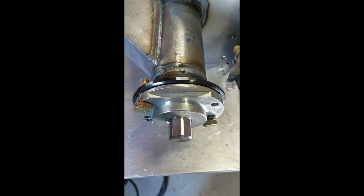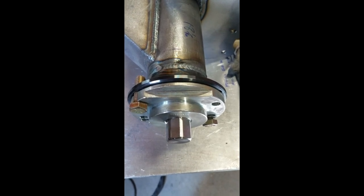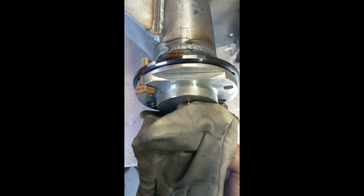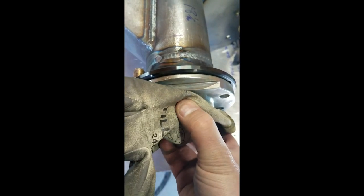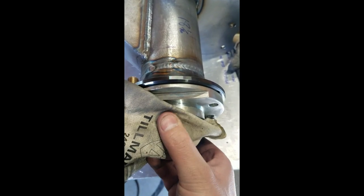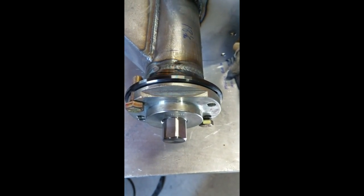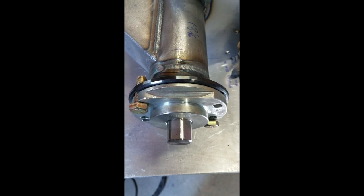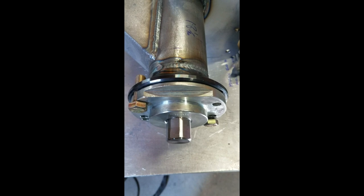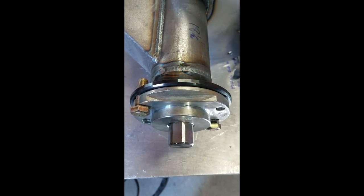When the housing end aligns with the tube really well, it makes it much easier to weld and hold concentric with the fixturing bar after it's been welded up. The puck is not tight in the housing end — it'll come right out. The idea here is to tack around the outside perimeter of the housing end at least eight times, if not more, in order to hold it in place when you really put the heat to it and start doing a finished pass on it.